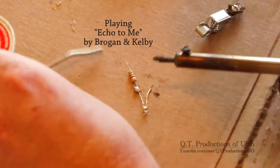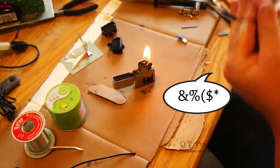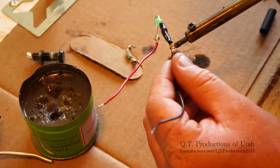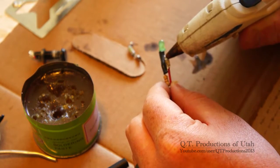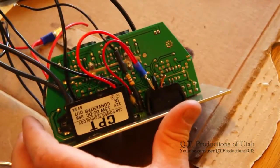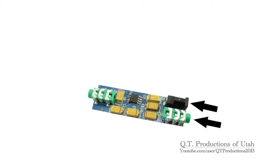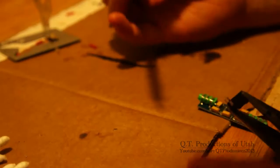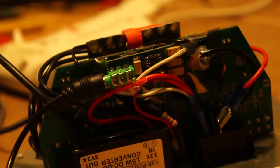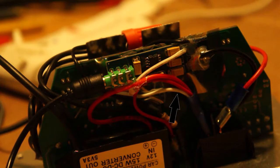I want an LED to light up whenever the Bluetooth switch is turned on, so I solder a 470 ohm resistor to the negative lead of a blue LED. I solder wire leads to it, but using a lighter to heat shrink the connections ruins the LED, so I try again with a green one, this time using my soldering iron to only shrink wrap the negative lead. I coat the rest with hot glue but leave the resistor uncovered so it can stay cool. I drill a hole right below the Bluetooth switch, insert the LED, secure it with hot glue, and wire it to the switch. I also add an inline noise reducer to help with noise from the Bluetooth receiver. Since the jacks for the power and line out are too close together to plug cables into both, I remove those jacks and solder the appropriate wires in their place, solving the design flaw and saving space. Now the audio cable is soldered at each end to both the noise reducer and the amp's PCB, and the positive wire ties in so it turns on and off with the Bluetooth receiver.